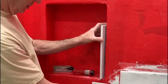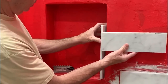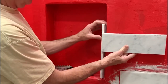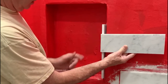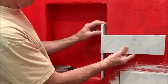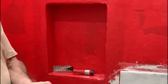If you miss the measurement in either direction, you want to make sure you overshoot. If I'm going to miss it, I want to miss it by an eighth of an inch over. If I'm too short, my tiles are going to meet where the inner tile is not fully covered by the edge, and that's going to look really bad. If I overshoot by a sixteenth or an eighth of an inch, I can build up the mastic to compensate. Make sure you're long if anything.